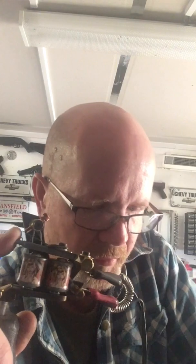in this section here. Needs to be quite a big gap there between the back of the armature bar. The bigger that gap, the more bouncy that machine is going to be. So you can make more of a hybrid machine. You probably don't want a big gap there if you're just looking for a liner machine. So that covers the tuning that I do with the armature bar. Now, just so you know, both those armature bars are exactly the same length.